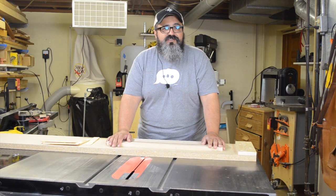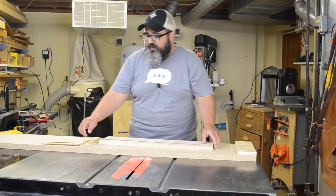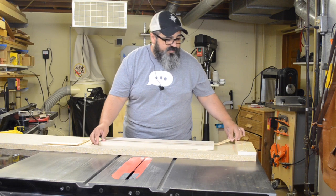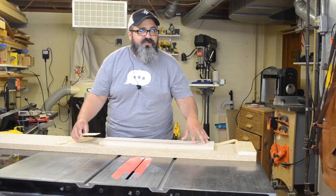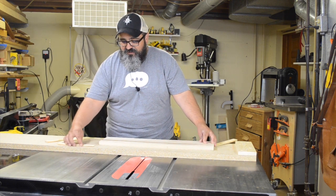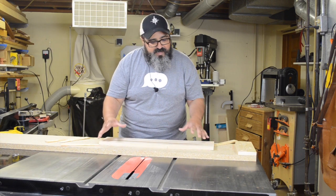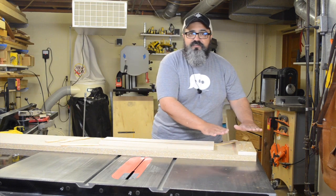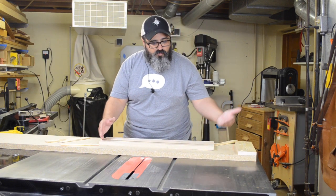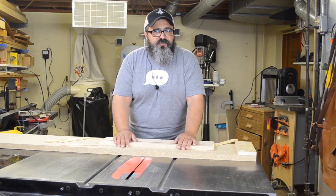I got to the same thickness either way. But if you want to conserve more of the material you're working with, rather than doing like I did — where I just clamped it at the one end and really hogged away at both ends — you can take the time to find that little sweet spot at either end to make sure that everything is shimmed down. That's going to remove less material overall, so you can get right down to that face maybe a little bit quicker and conserve the material in the end.